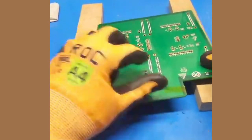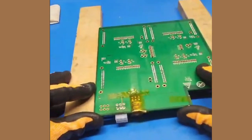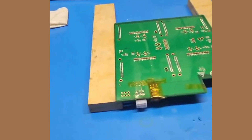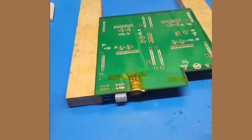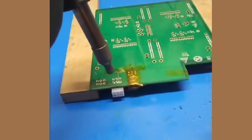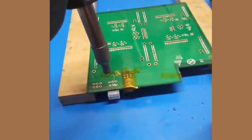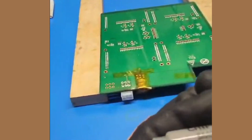Let me focus the microscope for you. You can actually see the pins there, so all I have to do is solder those on. First thing I like to do is get these pins a little hot — it helps the solder paste stick better to these solder joints. We're just going to heat this up lightly. I've cleaned the pads and solder joints with IPA, and we still have our Kapton tape protecting our nearby components. We're going to take a little solder paste.